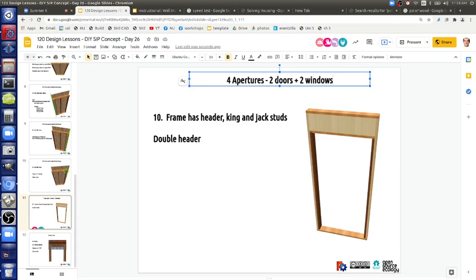Yeah. Are they usually smaller or bigger? Smaller. 36 is the most common front door, and then 30 inches is the most common exterior and interior door. There's a lot of detail to what you just said, and that is, if you call it that, it does not mean that the rough opening is going to be that. So there's distinction. Absolutely. I'm just saying, the most common American ones that you get in the store are those exact ones. They're probably getting wider. Yeah, they used to be 30.